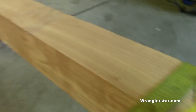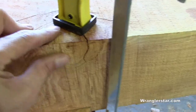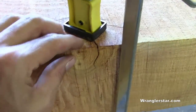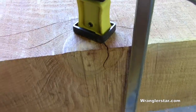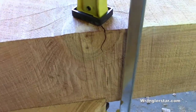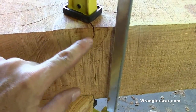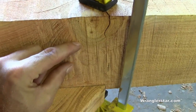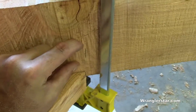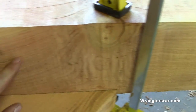This demonstrates why it's so important when laying out your timbers to look and see how they're going to lay out. Not working from plans, I'm at a bit of a disadvantage making it up as I go. But we just dodged a bullet — this knot right here. Chiseling in knots is a nightmare and you'd want to avoid it if at all possible. This mortise is going to be just underneath that, but it could have easily landed on that knot.